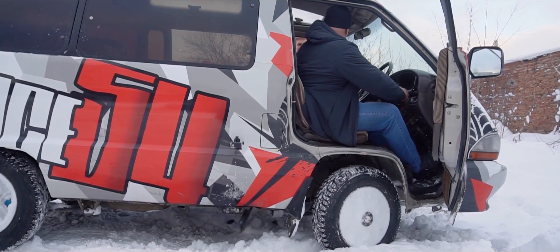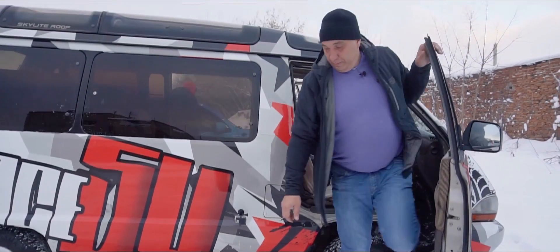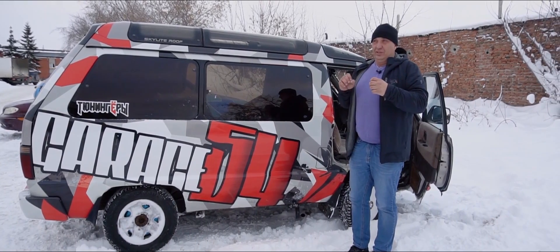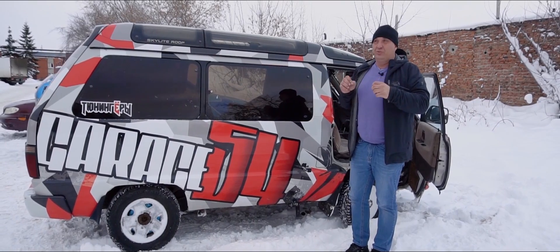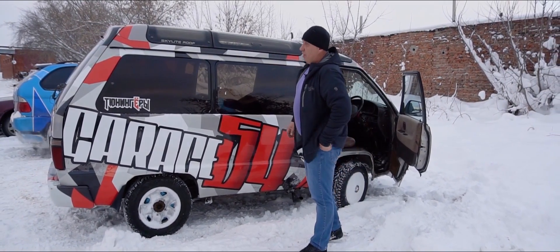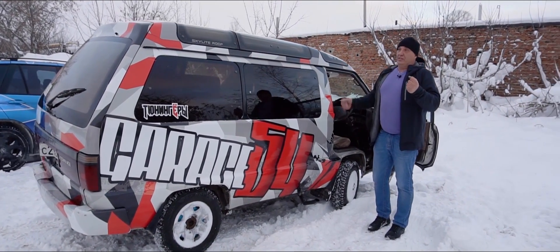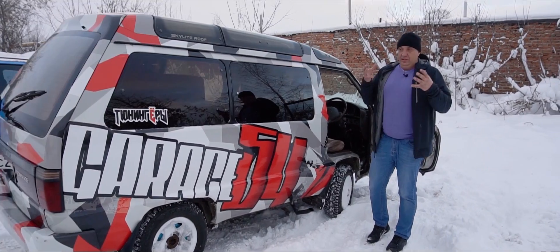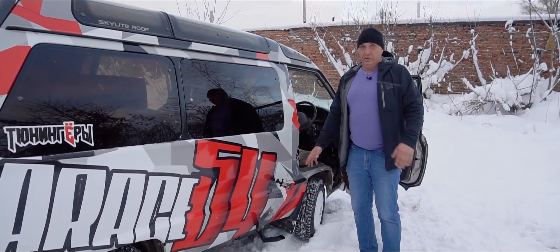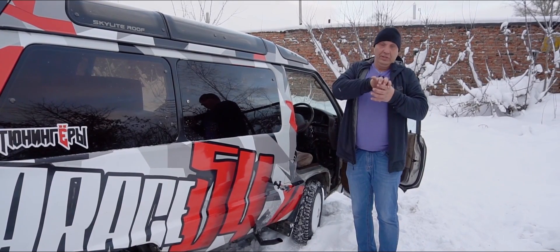It's got a pleasant sound to it. As we expected, the engine was happy to run on kerosene. Even if it does sound a bit different — it's got a slight ring to it — otherwise it's all good, we've got plenty of grunt. The van happily makes its way through the snow. Now look at how we routed the exhaust pipe. We actually fitted this motor with a new turbo, but since we didn't want to trash it, we took it off and stuck on a piece of pipe. We're running a straight pipe from the motor without the turbo.